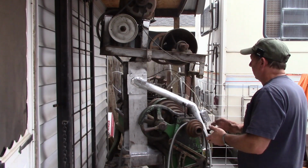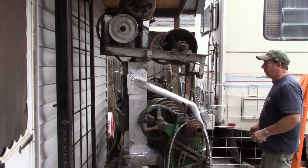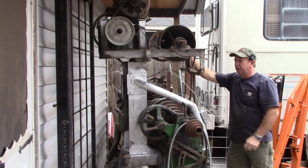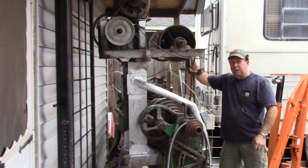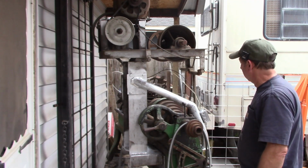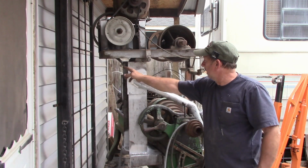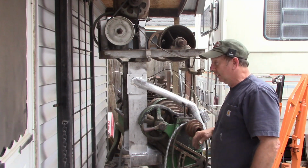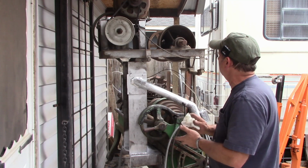Okay, well, this is actually a little bit anticlimactic here, just because I've gotten as far as I can right now. Once the belt's installed, it'll set at that angle right there, although I have some adjustment, so it depends on how good a job I do lacing the belt, cutting up the length and everything. I've got a new piece of 3/8 shielding to run from the box around and back down here into the box. I don't have enough wire yet to do it, so I just got everything temporarily put together, just enough to where I can run it.